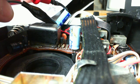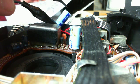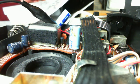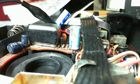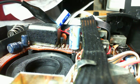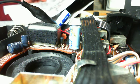Which we expect to see 6.3 volts on it? Well, how would that be? Why wouldn't you just see the 4.5 input voltage on that capacitor? Because that is what we see. We just see the input voltage. Oh, is that the capacitor rating? No, it is. That's the capacitor rating. That's not the voltage. It's just the rating, for crying out loud.